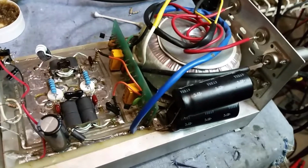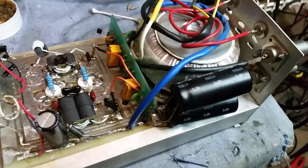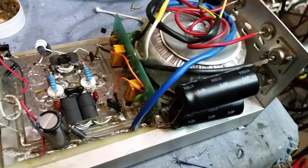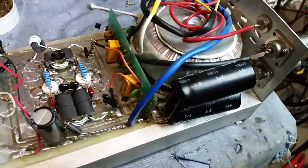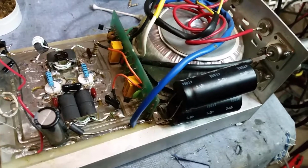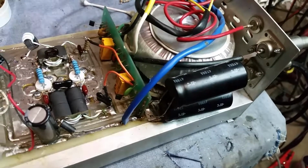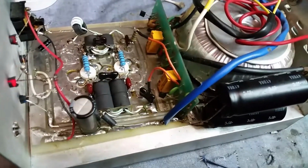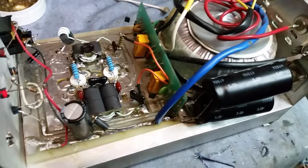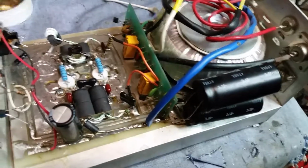I mean, you ask yourself, if you put more of a load on it, will it help? But the thing about it is, once you get past the duty cycle, like let's say this transformer is a 17 volt transformer, for example. Once you get under 17 volts, you're past the duty cycle and you're sucking the transformer clean. Like right now, just with these 454s hitting it, it's sucking down to about 15.8 volts. You know, it's pretty high on the voltage, but that's just what this amp does, man.